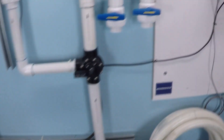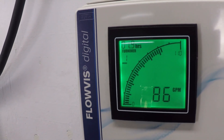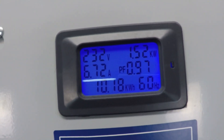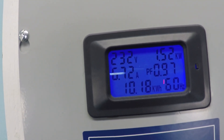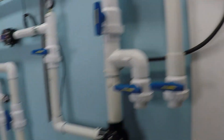Knocked that down to 3,000 RPM — take a quick look here. Lost about 16 to 18 gallons per minute. Power consumption has dropped a lot, but we're looking for just about 1.125 kilowatts. We're just over 1,100 watts, so we're still a little bit high.